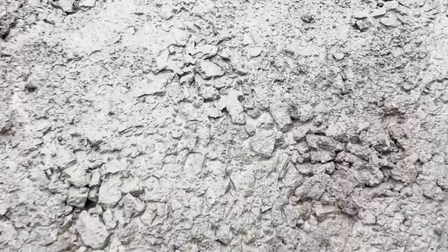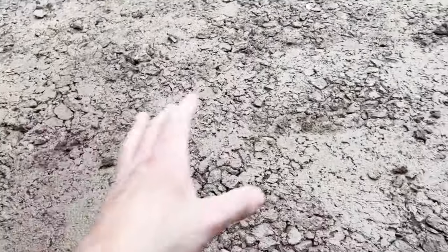We're done for today. We've laid the first layer of sub-base — the MOT Type 1 — and we waited about an hour for the rain to stop before coming out. The ground was still a little bit wet, so when we compacted it with the wacker plate it brought quite a bit of moisture to the top. That was to be expected — the compaction pushes all that water up. First time using a compactor plate; not too bad, quite easy to use once you get going, a bit tricky to start.